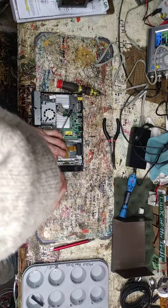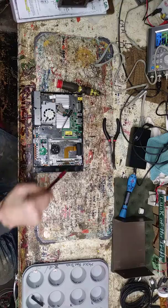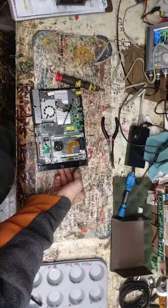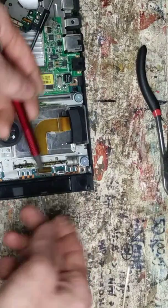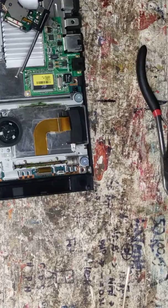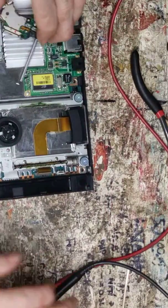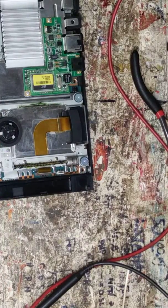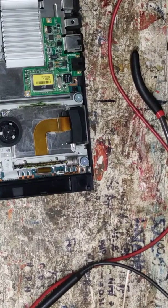It's going to be too hard to trace these pins because they're so tiny. It looks like half of these pins come off this side right here, down the back — there are pins right there. On the other side the flex runs down in there, so they split off both sides, one pin on each side. I need to get my fine test lead pins and poke around in there. I'm trying to simplify it by following the trace out — if I had the circuit schematic it'd be nice. The switch is definitely working; you just barely touch it and it goes off. So I've got to follow it through on the board. I'll get a game plan together and we'll be back.